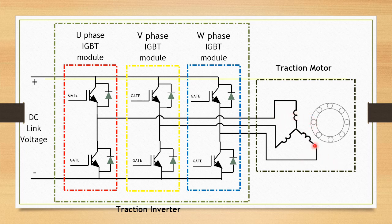The field winding is connected in star connection. When three-phase AC is supplied to the field of the traction motor, this field winding creates a rotating magnetic field with rotating N-S poles. This magnetic field is of rotating nature.